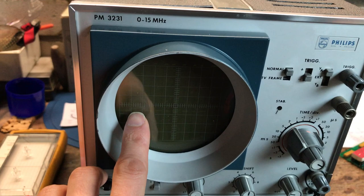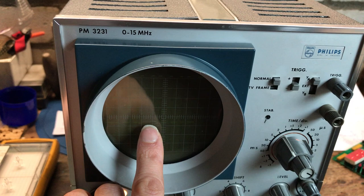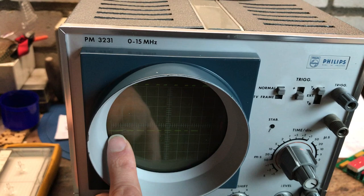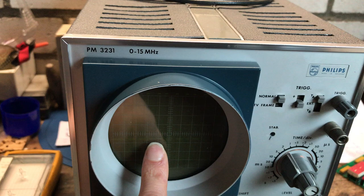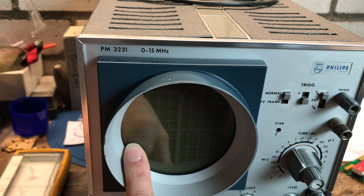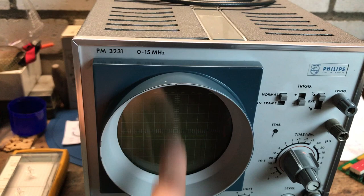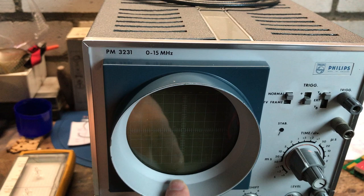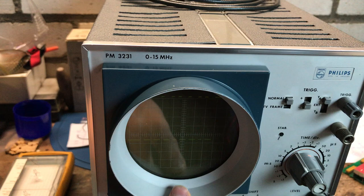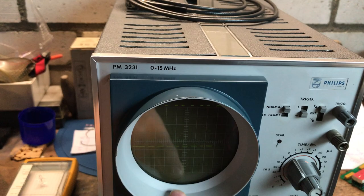If you look closely you can see a long start bit followed by eight other bits of actual data. The bits are either long or short duration. Measuring them: the start bit is 2400 microseconds, the long bits are 1200 microseconds, and the short ones are 600 microseconds. This is exactly the timing of the SIRC remote control protocol that Sony uses, except this is 8 bits long while the Sony remote control is mostly 12 bits. And of course there's no 40 kHz modulation since it doesn't need to transmit over infrared.